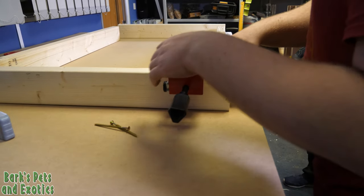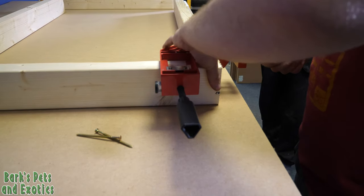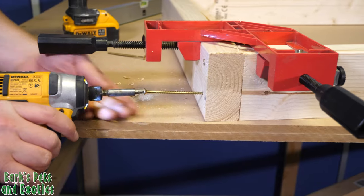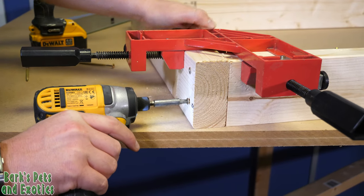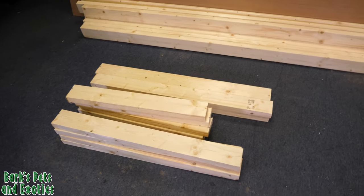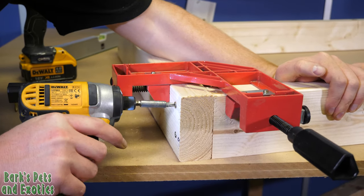So to start off the actual build process, measure out and cut all of your pieces beforehand, this time choosing which are going to be your outer pieces and which are going to be on the inside. Then take away the excess material caused by any overlap so that everything fits together and gives you your desired dimensions. I suggest you stack all of your pieces in different piles depending on the length of the cuts you've made to make them easier to find during the building process.